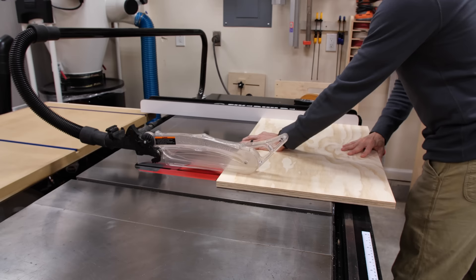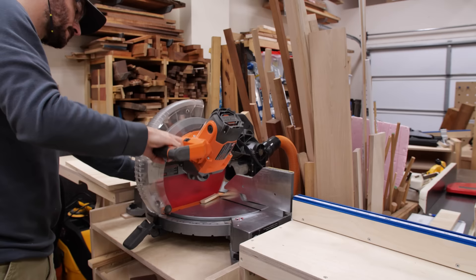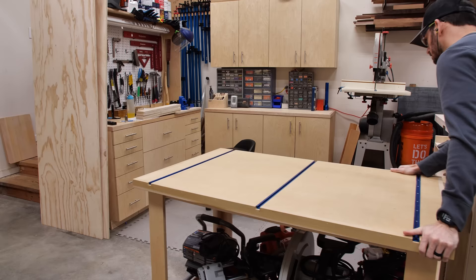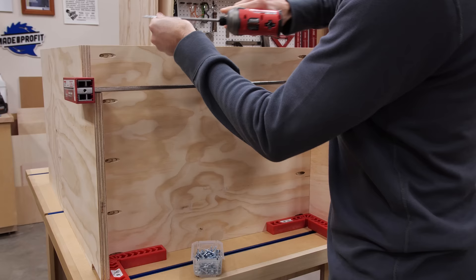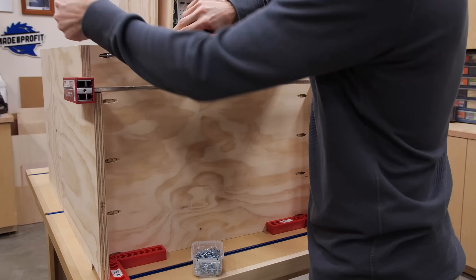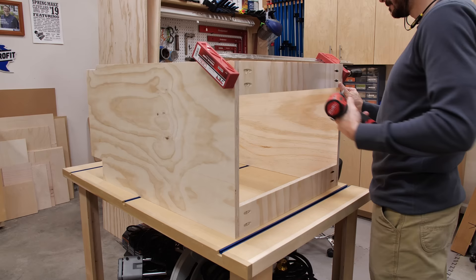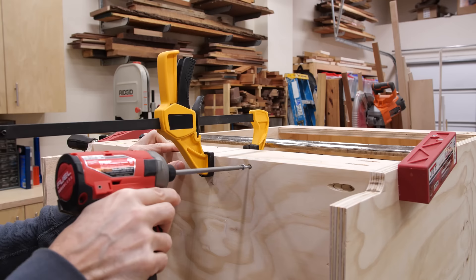The sides are joined by the bottom and four supports which will also help attach to the top and secure the cabinet to the wall. I cut the parts to size and went to the bench for more joinery. I'm using pocket holes for quick, sturdy joints and I finally upgraded my old K4 to the K5 jig — it's definitely faster and more convenient with that front lever. Assembling on my mobile workbench wouldn't work because it was too skinny, but the new outfeed table worked great. I secured the bottom with pocket screws, then flipped the cabinet over and secured the top supports using large clamps. The back supports got attached to the sides with two screws through the top and bottom to prevent any bowing when securing it to the wall.